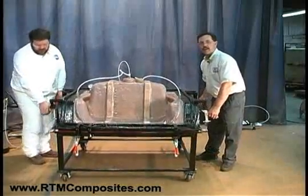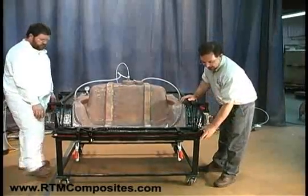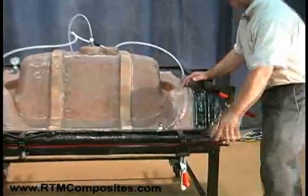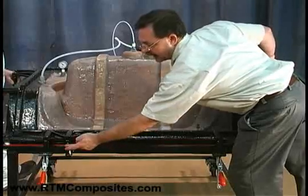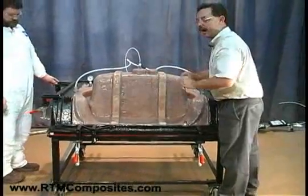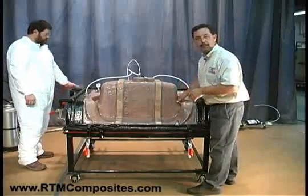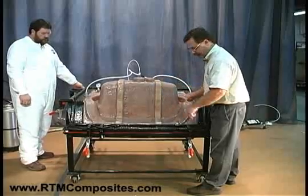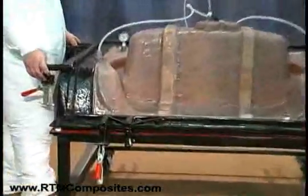You can see there that we've got the upper matching up. We align the upper — in this case we had two alignment illustrations. One was some Teflon blocks on the flange, but most commonly we use dowels on the outside of the mold. There are two dowel sets, a male and a female receptor on the top, that set the X, Y, and Z plane of the mold half. This puts the mold halves in registration, which is critical for part thickness — both in the horizontal and vertical planes. That registration can also be done by molding in or attaching dowels on the surface.